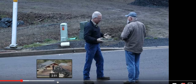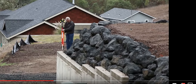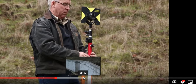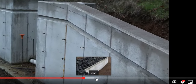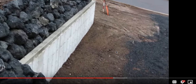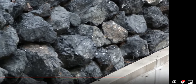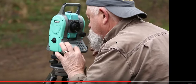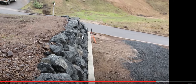Look at this — there's that wall. He said he's going to put car loads on top of this. This is just a nightmare. He's real proud of showing this super surcharge on top of this wall system. That will cause your wall to fall over from the top down.